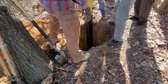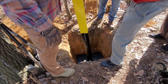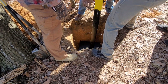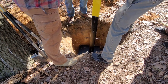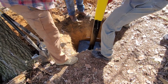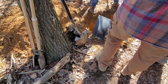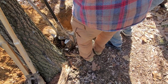These new posts are great. They have spikes on them so that the concrete can adhere on all four sides, giving us extra hold so they're not going to be able to come out. We were adjusting a little bit, doing this in all three holes, and then we've got to start adding concrete as well. We noticed we're not turned exactly the way we need to be, so we pulled it back out and adjusted the hole a little so that the post can fit in the proper orientation.